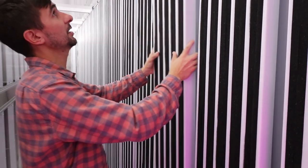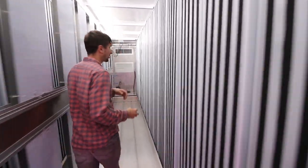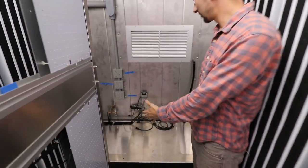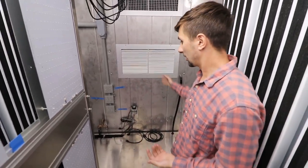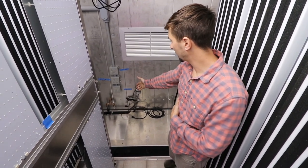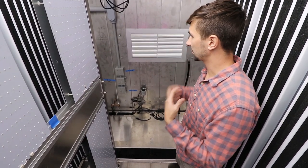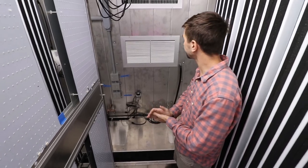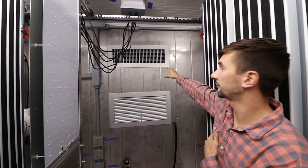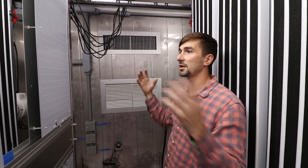All of the nutrition is in the water itself — a standard hydroponic system. The main tank holds about 120 gallons. We have an array of solenoids to bring water in from an outside spigot, and a drain spigot as well. We also have active oxygenation through an air pump to keep the water from going stagnant. The intake and exhaust grates for the AC unit are mounted to the rear of the farm — it's about 36,000 BTUs, powerful enough to handle all the heat the LEDs produce.